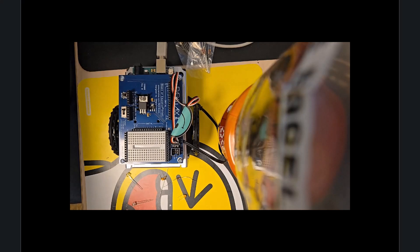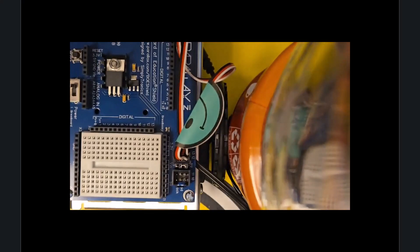We're going to go ahead and utilize this — let me move a little bit here to give us a better view. We're going to use our resistors and plug in to signal eight and signal six — digital signal eight, digital signal six. I've removed our little whiskers. We're going to plug eight in there and plug six here. We also want our sensors at the top of the board.